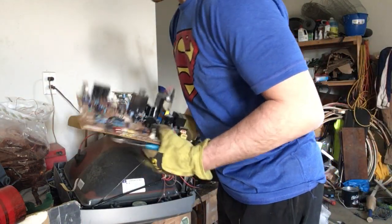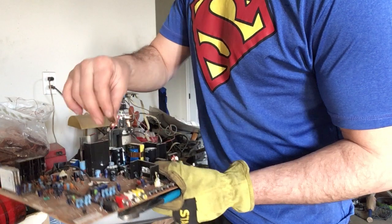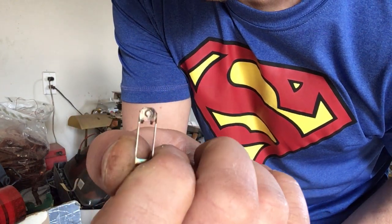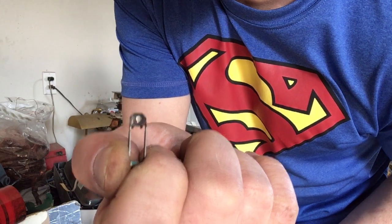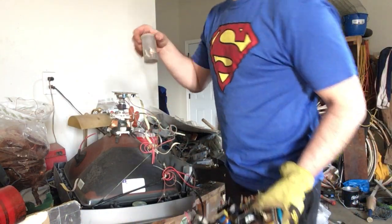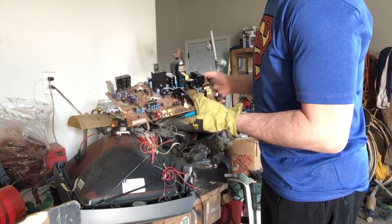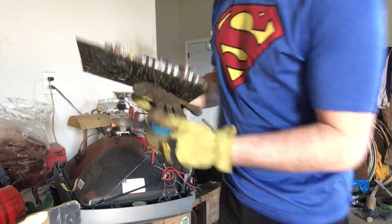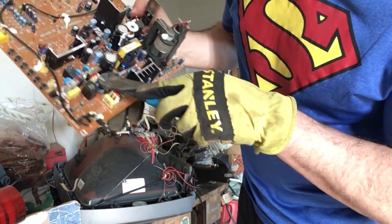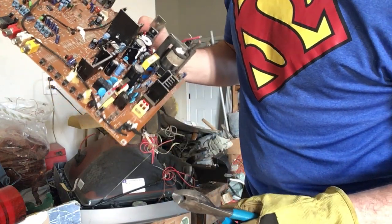If you don't know what a silver contact is — once I take it apart, there is actually a spool of copper, a little spool of copper on that. The copper is obviously good, very thin but it still adds up. And there will be a silver contact. You can see the end tip, there's a silver circle — that is silver. So I usually cut those off, I put them in the container, and like I said, I store them up and eventually when I have enough I'll hit them with some nitric acid and hopefully make a small bullion. I'll take the aluminum heat sinks off — there's just a screw holding it in. I will take the copper coil right there off. There are two of them there, as well as those two silver contacts.